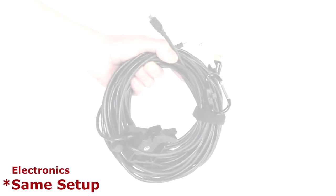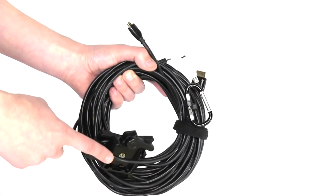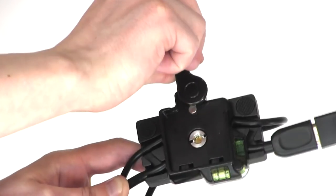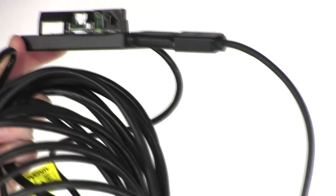Here is the set of cables that will run the length of the tower for the HiPod Superlight. I want to bring your attention to the quick release and strain relief plates that are pre-attached to the cables — this is where the camera is going to snap in and out. There's a lever that you will need to pull back to accept the camera, as there's an adapter pre-attached to the camera. Note that HDMI comes out of one side and the remote cabling will come out of the opposite side of these plates.